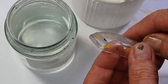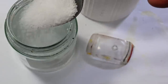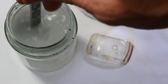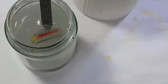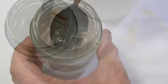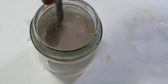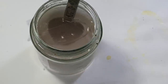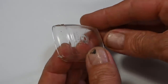The final part is this windscreen with all that paint on it. I've got a jar of hot water from the tap and I'm going to add a spoonful of caustic soda, mix that up, then drop in the windscreen and leave it for about five minutes. Here it is five minutes later — you can see the paint is starting to dissolve off and staining the water. Most of it has actually come off the plastic already. I'll take it out and rinse it off.